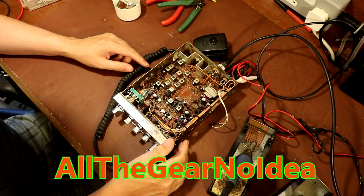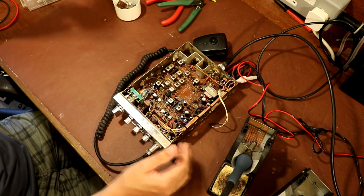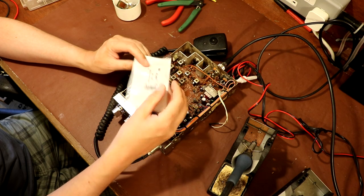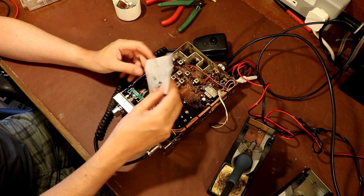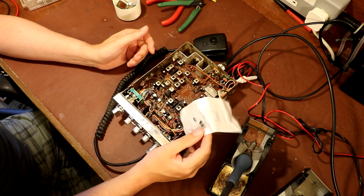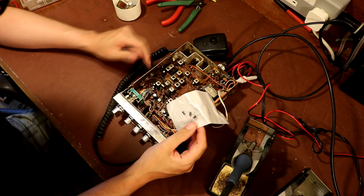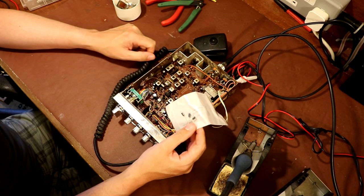Well, it's a couple of days later since you joined me last, and found I was missing a capacitor, and the one that I actually needed was a 0.22 microfarad. So I went away and ordered some of them from RS, and got a few bags of them, and that's one that goes on one of these PLL pins down here. So that's the last one.